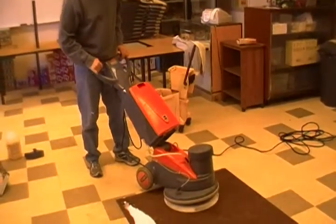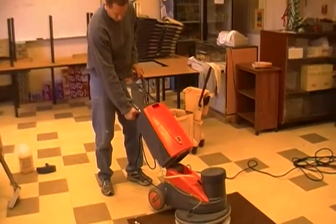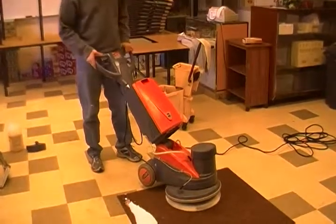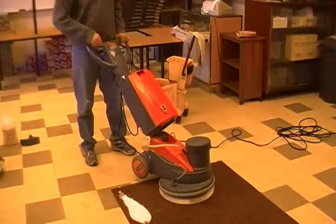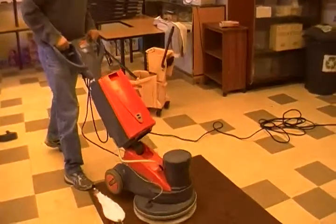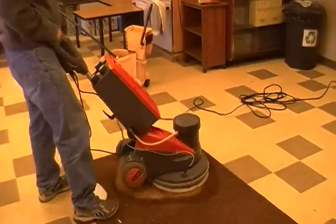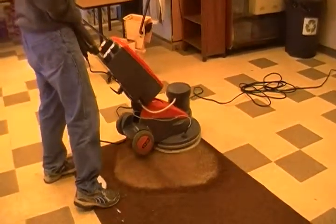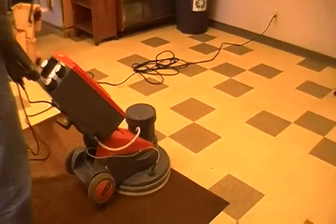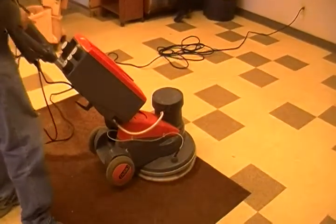When you start cleaning carpet with this, turn the foam generator on. Most people set it at about two or three. You want to get that brush a little bit wet with foam, because otherwise it will drag a lot. You can see the foam going on the carpet, and you just work that foam into the carpet with the carpet brush. I'm going to turn the foam up a little bit higher — you want a little bit more foam than that.